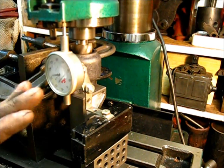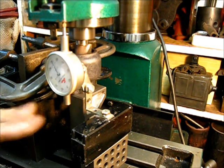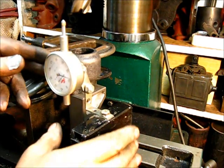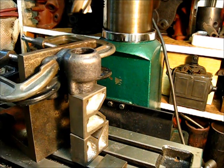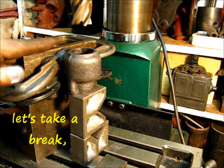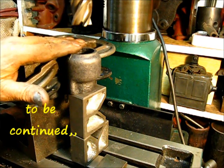That's 40. I'm going to quit right there, just let it ride a little bit, kind of polish it at 50 thousandths — we're going to stop at 50 thousandths. To make this easy, I'll set up a different depth gauge, leave this where it is, and I'll take 50 thousandths — put the depth gauge over here and over here and take a skim cut right here of 50 thousandths off the top of this, and we'll be finished.